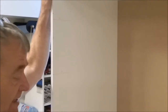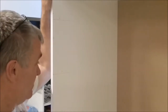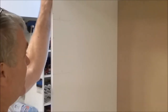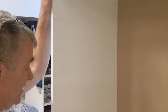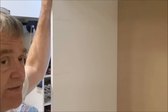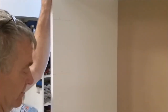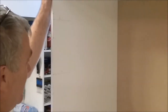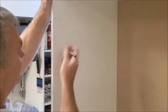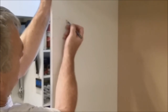I don't have a drawer slide jig. Never used one, but I'm assuming that the companies that do make them, from what I've seen, they're a good and useful tool. The way I've been doing it, well, I've been doing it for years, hasn't failed me yet, so continue to do that, which you'll get to see when I go to mount the drawer runners on, the way that I actually do it. Just a brief description of the way I do it is I have a panel that I cut to this point up here, to the bottom of this top drawer slide.